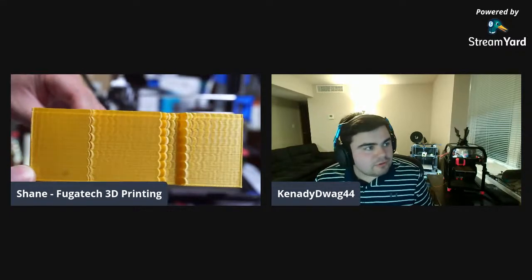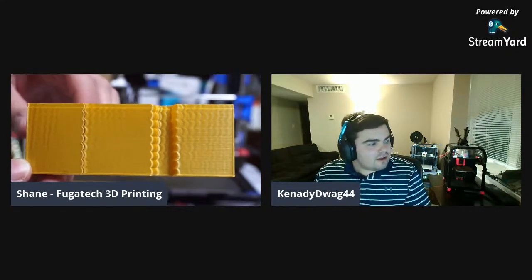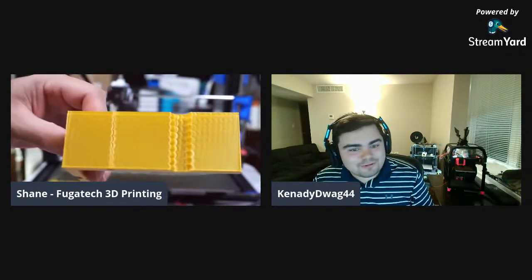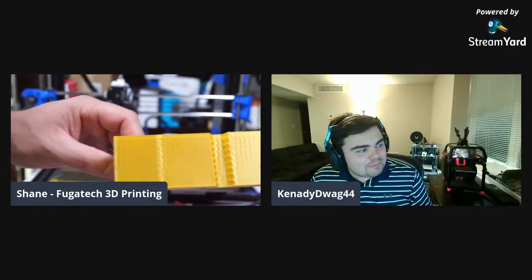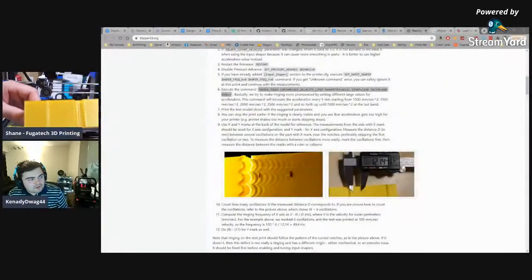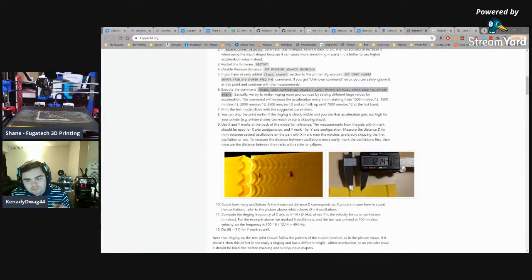So if you go onto the resonance compensation page, actually it's kind of funny, you used the same color he did for his photos. Oh yeah. Yes, and do you see how he put those two vertical lines with a Sharpie? So you want to find wherever the ringing is most pronounced, put those two lines, and then count how many artifacts, I guess we'll call them, there are from the first line to the second line.